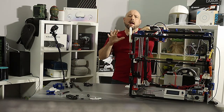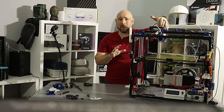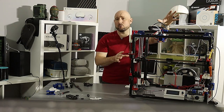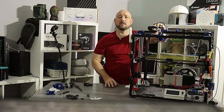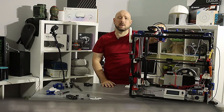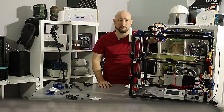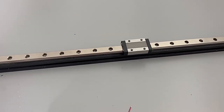Back to the X5SA. At the start of this video I showed the completed installation printing using a Bowden carriage, however I prefer direct drive so I'm going to tear everything down and rebuild it as a direct drive - you have the option of building either. Unfortunately I no longer have the included hot end and leveling sensor that came with the X5SA, so everything here is based on the E3D V6 and a BL Touch. So the first thing we're going to do is install the actual MGN12H rails.